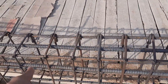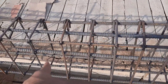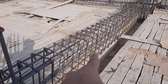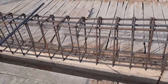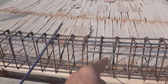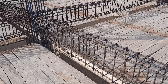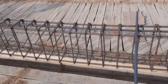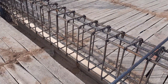You can see we have three steel rods at the bottom, three at the top, and two are sidebars. These two steel rods are sidebars, specially constructed for the L by 4 distance where we have negative bending moment, or where we have more chances of cracks. To resist cracks, we are providing sidebars as extra bars. In the mid section we don't have sidebars, but at the distance of L by 4 you can see sidebars are available there.